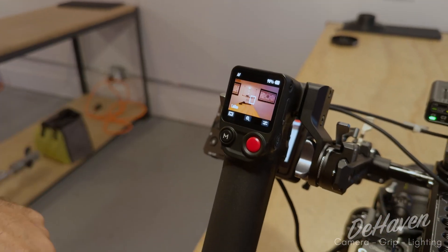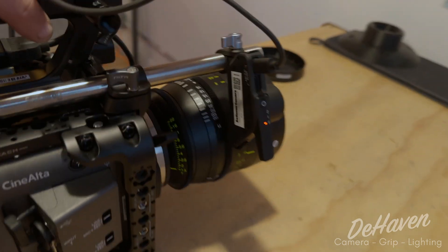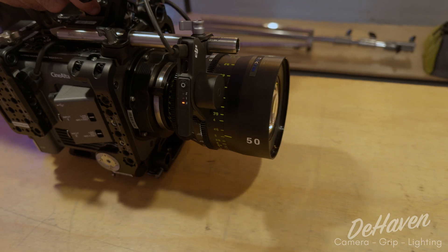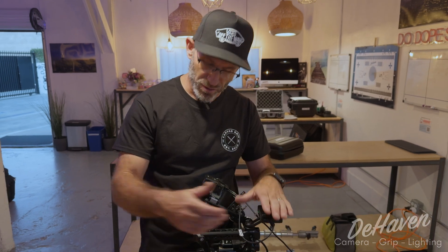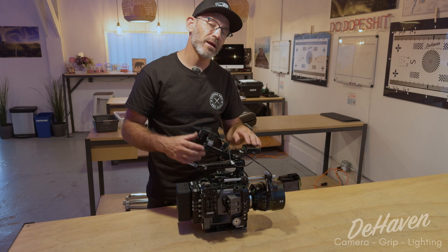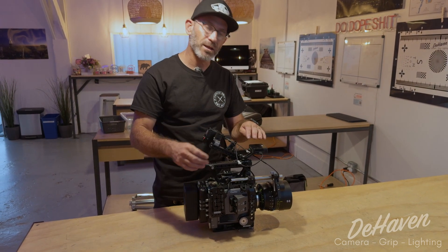We can see that our lens profile is set. We now have an autofocus system based on the LiDAR. That's the correct way to configure the DJI LiDAR for the Focus Pro with the handle. Make sure that you don't plug in any other USB sources or power this system from any USB ports on your camera. Only use the handle battery or the DJI transmission with the LiDAR connection cable.